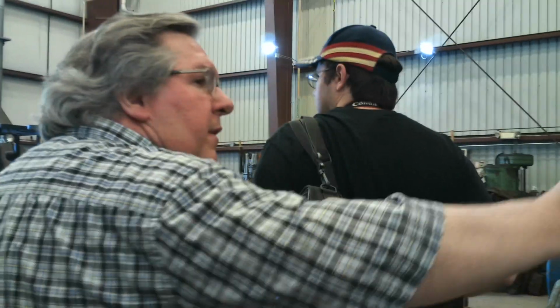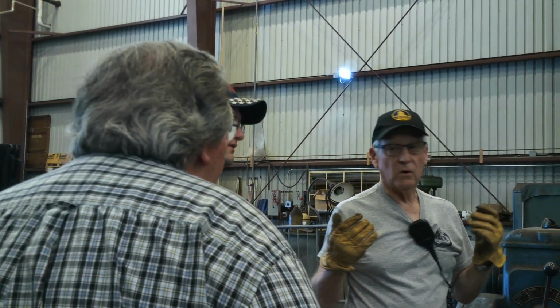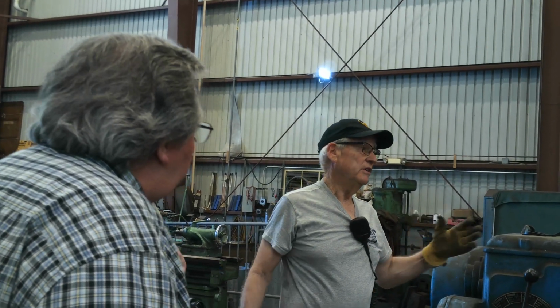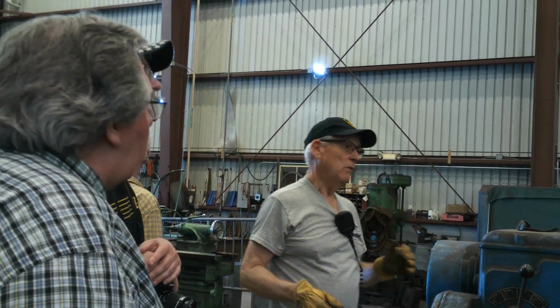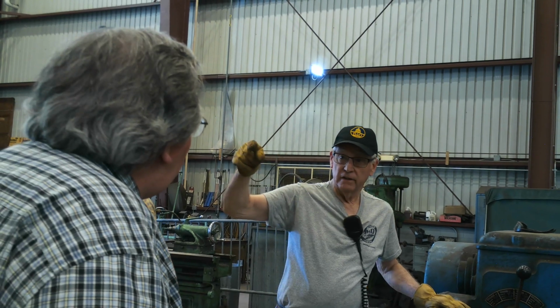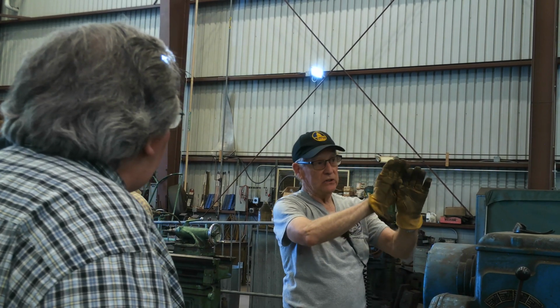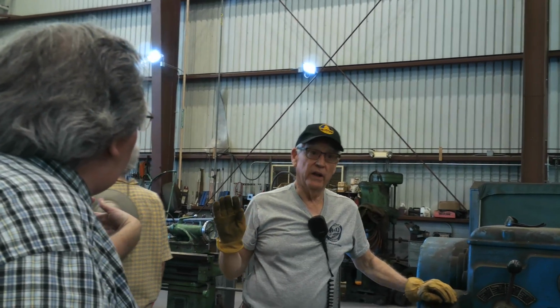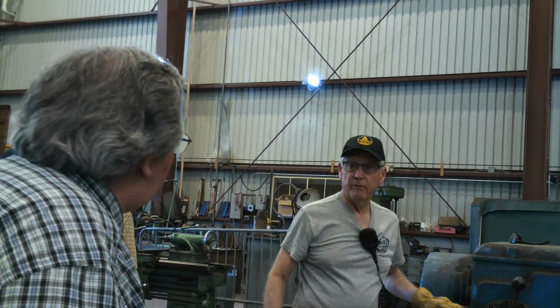Yes. When you repair the holes in the steel, do you patch it, or do you have to replace an enormous piece of steel? Of course, it depends. The question was, when we have to patch something like the rust there, what do we do? It depends upon the area and the material. But generally an area is cut out, usually using a torch, a new piece fabricated to that shape, including curved as necessary, like the corners here, and that's put on and welded, and then the welds ground down until everything is absolutely smooth as part of the prep for painting.